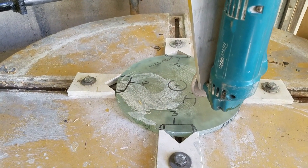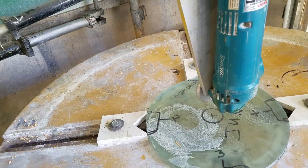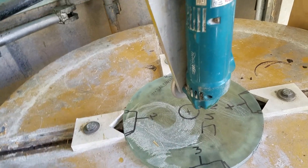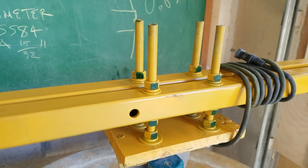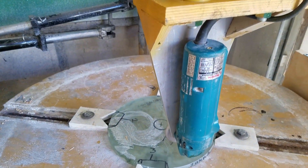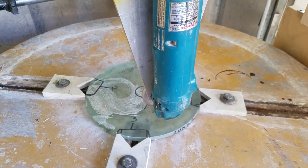I'll go ahead and run the motor — it'll be lower and may go faster, just depends on what this thing feels like. I can go in a little further and a little further until I'm finally there. I never like to go more than a 20th of an inch, so my first pass will probably just be from there to there, then I'll crank these down one turn — that'll be a 20th of an inch.